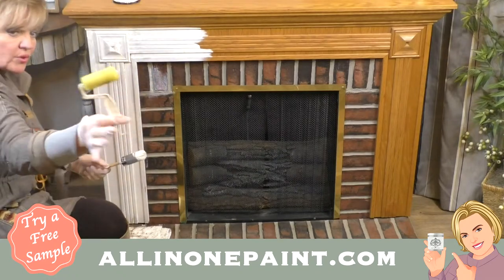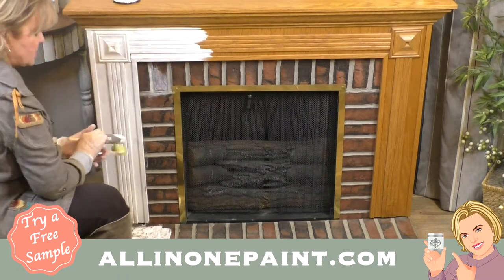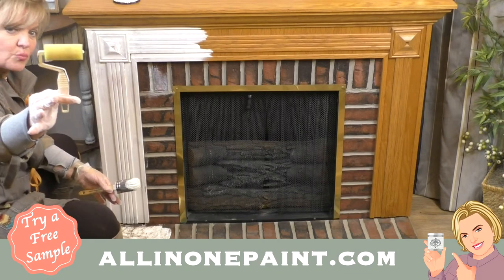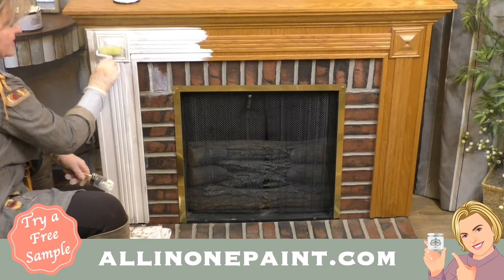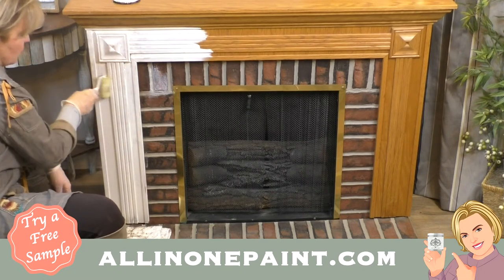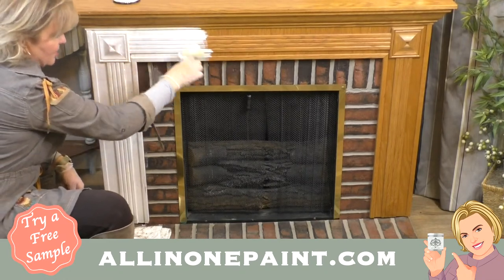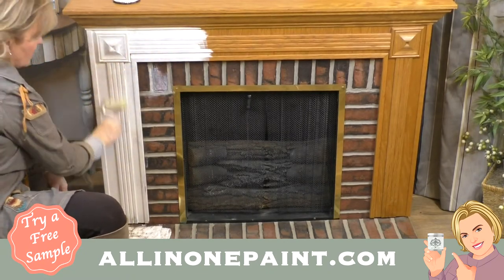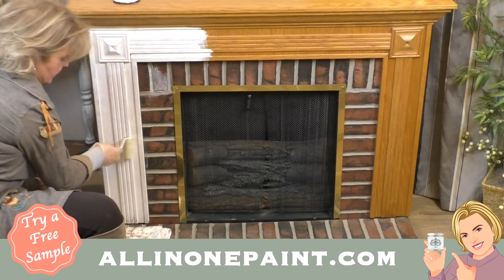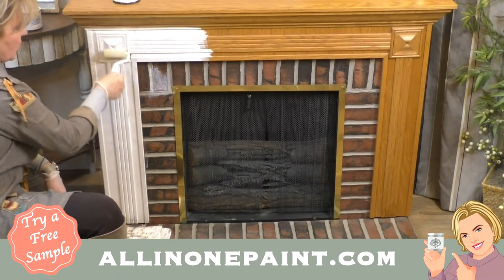I'm using our little roller with open cell foam. If you're using solid foam rollers or those little textured velvet rollers, they just push the paint around — that's not what we're trying to do. We're actually using this open cell roller to finesse and move the wet paint. We're not trying to apply paint with the roller, just going in to remove all the brush strokes. Dry roller right to the surface — I'm getting a really beautiful finish, pushing a little harder because of all this risen texture and beadboard.